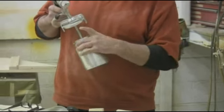Because you notice what we've got. The curl is standing out. The hard grain on the surface, you know, it's back to white. And so what you notice is that the only thing showing is the curl. So when we come back and dye this the final time, then what we're going to get is that curl is just going to blast out of there.